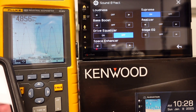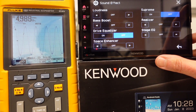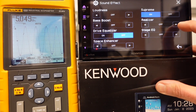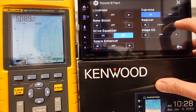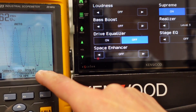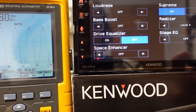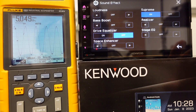Back to the one kilohertz test tone. Supreme on and off — with Supreme off you get less output, so another good reason to leave Supreme on to get a little bit more output. Realizer — that's boosting it a little to the point where it looks like it's starting to clip, with a little bottoming out. It looks like it's bottoming out down below while the top looks smooth — I would leave Realizer off, the signal definitely looks smoother without it. And stage EQ drops the output too.